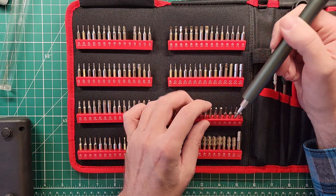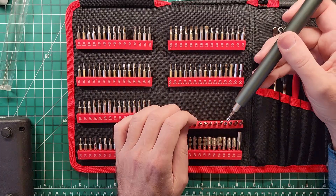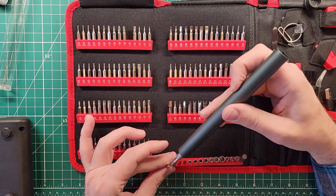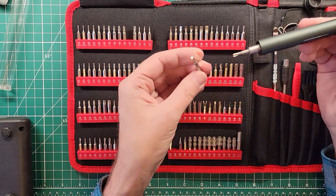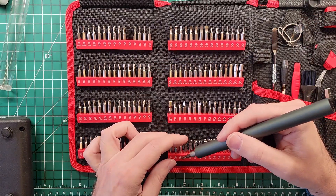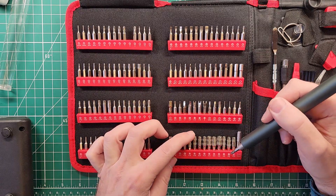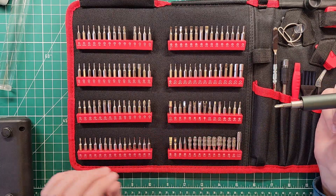Eight squares. These are just called SIM — probably the same thing as this one over here, but they're just little pokey jobs. These are called mids — those are interesting. And then this one is curved, this one's a flat — FS for flat square and PB for parabolic. This curved one you could use to pry stuff up. We've got conical points, 0.1 and 0.3 and they just get bigger. Then these are for nuts, 2.5 through 4.5, and then internal Phillips, and then the adapter.